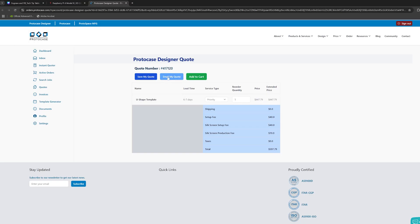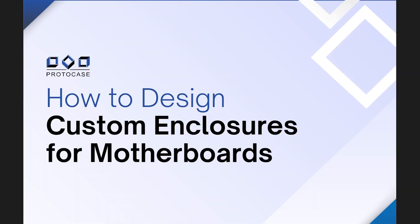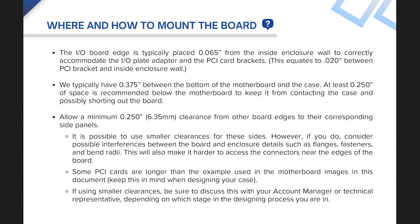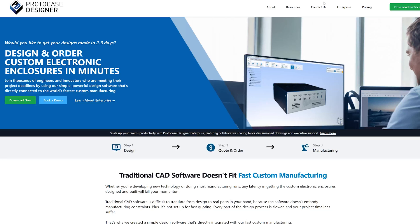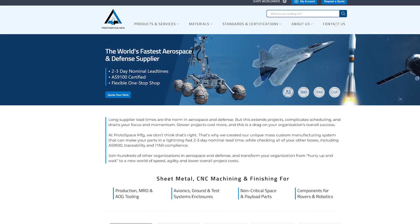One last thing before finishing up is to add some graphics to the cutouts so that we know which inputs are for which components. I'm going to create text graphics for my USB ports — both USB 3.0 and 2.0 — my Ethernet port, my USB-C power port, and my micro HDMI slots. So there you have it — we now have a custom enclosure for our Raspberry Pi. Within a few simple clicks, I can receive a quote for this design and send it immediately into manufacturing. This process nearly took the entire length of this video to complete, but we just wanted to prove a point about the speed and convenience of Protocase Designer. If you're interested in learning more about designing enclosures for motherboard-based systems like Raspberry Pis, we have a guide on our website linked below in the description. As always, if you have any questions, please send us an email at info@protocase.com or info@protospacemfg.com, or chat with your account manager directly. Until next time, take care.